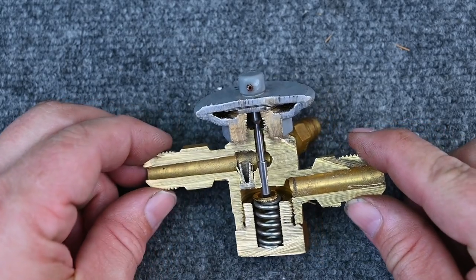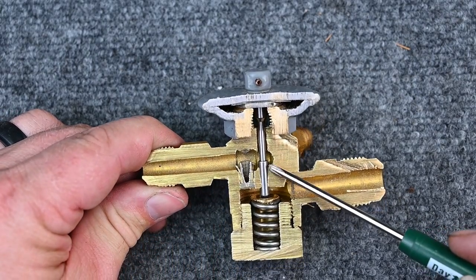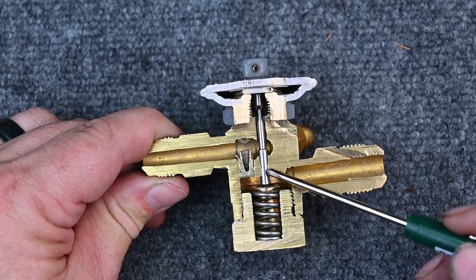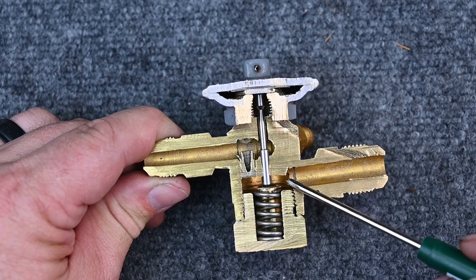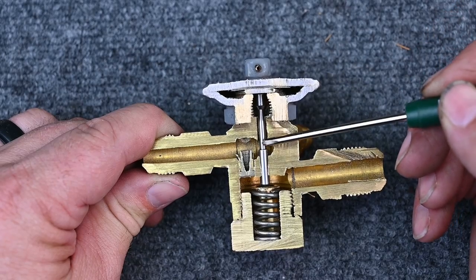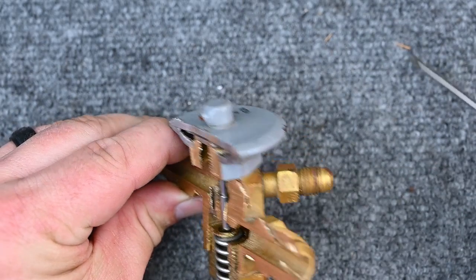The power head mounts on top of the valve body. Refrigerant flows in through the liquid side, through an opening where a pin controls the metering. The chamber is cone-shaped, so the pin opens and closes that orifice — increasing or decreasing refrigerant flow. After passing through the metering device, flash gas occurs, boiling from liquid to vapor, producing a saturated mixture going to the distribution tube and evaporator.